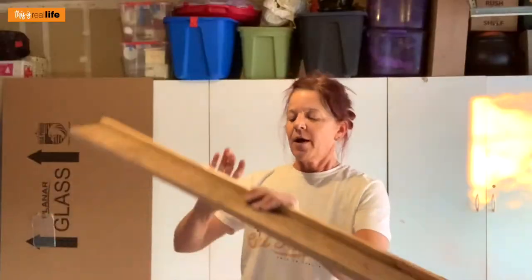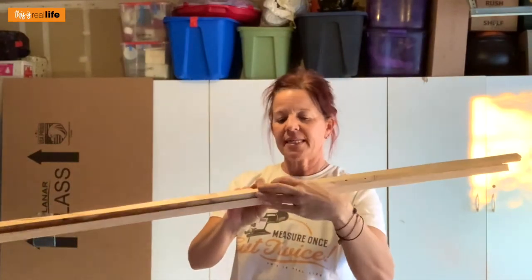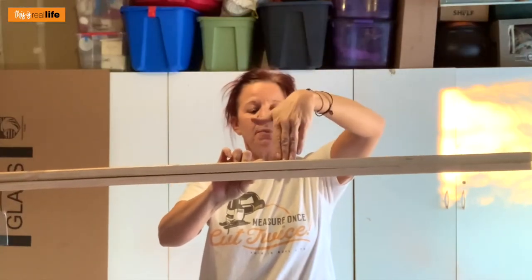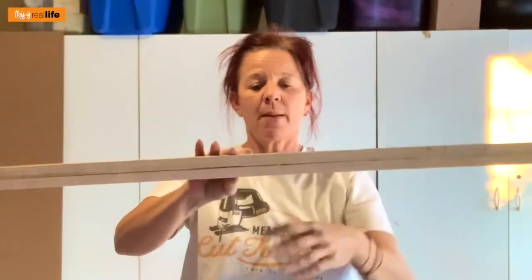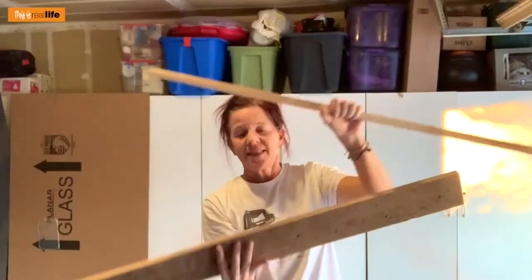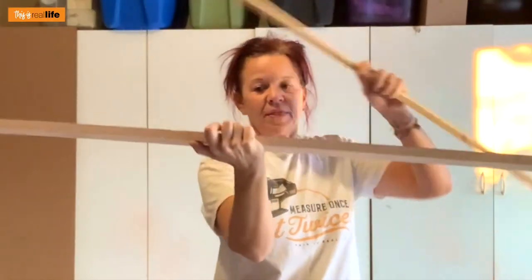So I have my shelf like this. This is my plate stop, and it needs to rest on top of this board so that if you do lean a plate, it doesn't slip off. You're gonna take your shelf and nail from the bottom up your plate stop to the top of that shelf. This is my shittiest piece of wood right here. I want that to be the highest shelf with this top up.